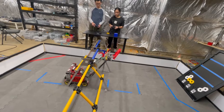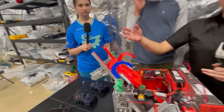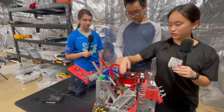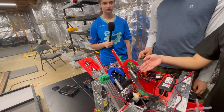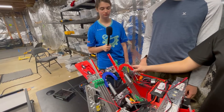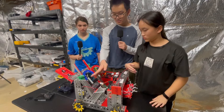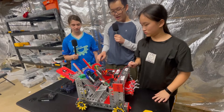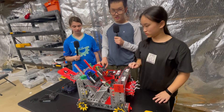Can you tell us about how you hang? We have hooks on our linear slides. We lift the linear slides, flip the arm back, and hook onto the bar, then lower them to the perfect height to hook on. Without the hooks, we'd fall off once the timer ends because the motors would just be able to turn. With the latches, as the robot goes down the bar pushes down on the latch, and once we reach a certain point the latch snaps back into place. After that, the robot is unable to fall when the match ends because the latches stop it from falling.